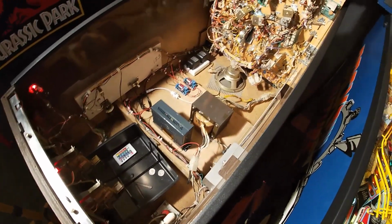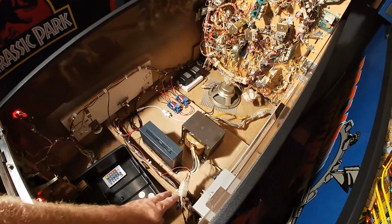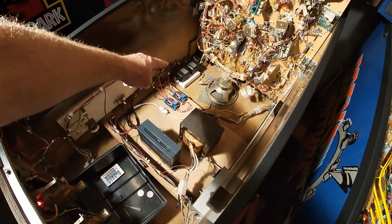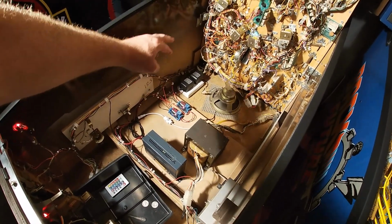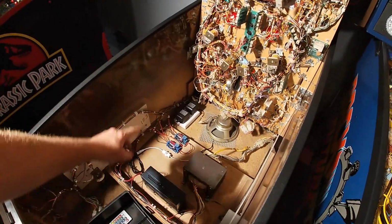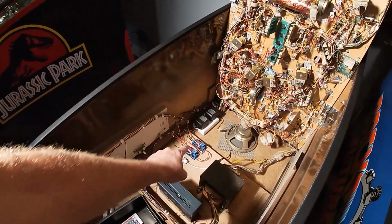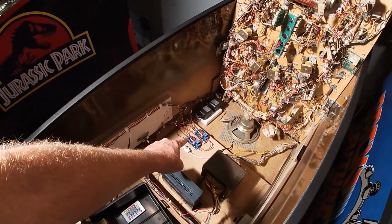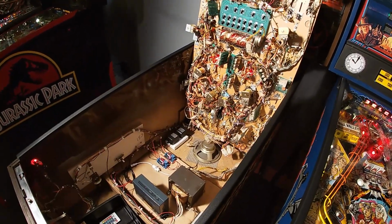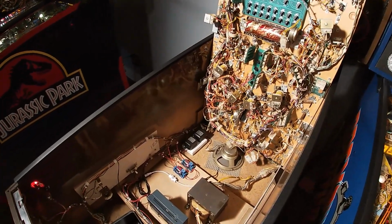All right, so what I actually did on this is you've got to have 120 volt power to run the two fans. So I pulled 120 volts off of the plug, ran it down, and made an actual physical plug-in. And then I could plug in the two little transformers for the lights up there. And then I came back and I've got two different timers. One timer, the 10-second timer, runs when you start the game. The 20-second timer runs when you get up to the ladder on the building. And so those switches come in.